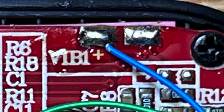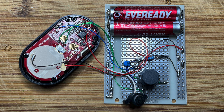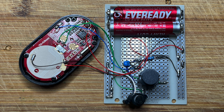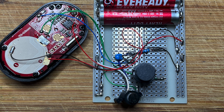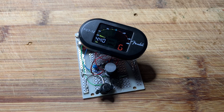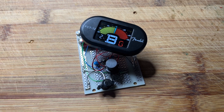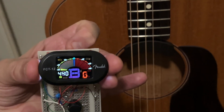The connection up the top, 'Vibe 1', was made to the original vibration sensor — the piezo element — and that leads off to the 104 capacitor. You can see the little blue capacitor on this additional circuit board. The green wires go directly from what was the power button to a new power button that I can access. Power supply is taken from the battery terminals to some new batteries installed on the new board, and the rest of that little three-part circuit is installed on the new proto board.